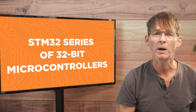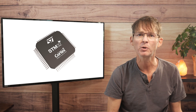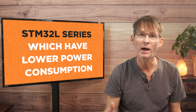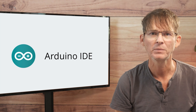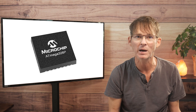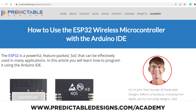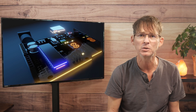Another option is the popular STM32 series of 32-bit microcontrollers, which are cheaper and more powerful than the ATmega. They also offer the STM32L series, which has lower power consumption. The STM32 can also be programmed using the Arduino IDE. So don't let your fear of leaving the safety of the Arduino IDE limit you to only the simple 8-bit ATmega microcontrollers. I've got several in-depth articles on my website on how to use the Arduino IDE with both the ESP32 and STM32, which I'll link to in the description below.